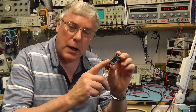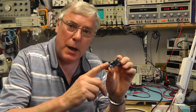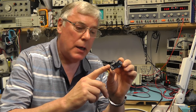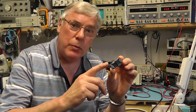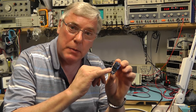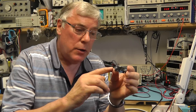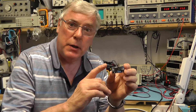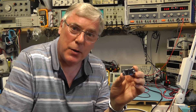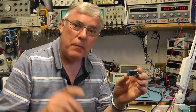In summary, these little modules can deliver 10 watts of power. They don't seem to be able to cope with the 15 watts suggested by some eBay sellers. Even at 10 watts you'll need a heat sink on the chip to keep it reasonably cool as it gets extremely hot. All in all, not a bad little module for the price, but it doesn't quite deliver what some eBay sellers suggest. Thanks for watching.